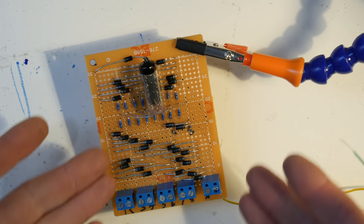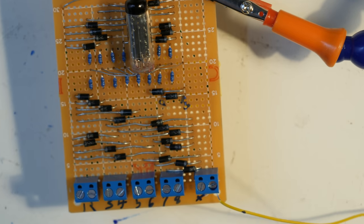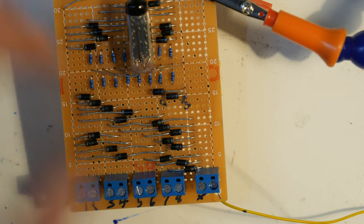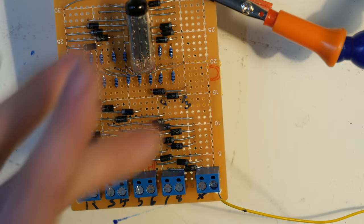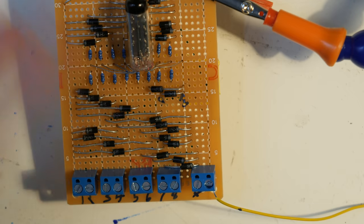And what I did then is I built this circuit board. What is below the Numatron is a bunch of diodes. This is called a diode matrix. And this basically means that I'm able to select the numbers, and the diodes actually isolate each number's choice from each other. If there were no diodes here, each of these selections would actually always just select 8, because all of the connections are being made all the time.